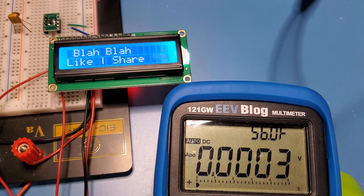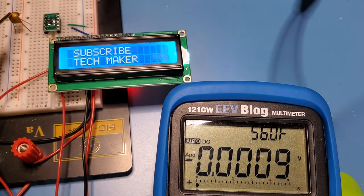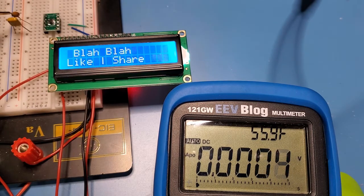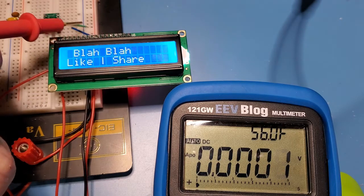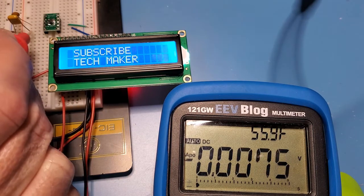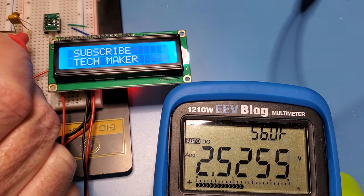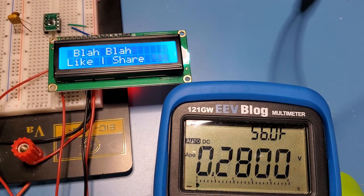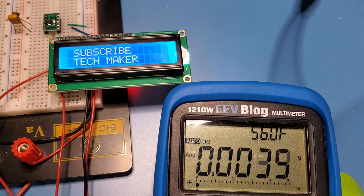Okay, so the 2.5 volt regulator is installed. You can see here, this is the output side. There's a 1 microfarad cap there, and a 470 picofarad cap right behind it. That's the bypass cap. And then here's ground, and here's 5 volts. So this is the output here, so let's probe across this capacitor. And as you can see, we have 2.524 volts coming out there. So that's the 2.5 volt regulator completed, and we can move on to the next step.